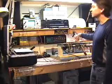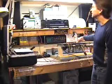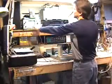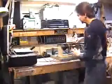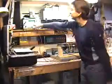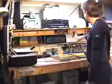I've got all of the tone controls set on medium, on 5, and now I'm just going to start raising the volume. And we're going to start seeing a nice clean sine wave come up. So this is exactly what you want to see. Everything's nice and symmetrical. If one of these tubes were really failing, you would see either the top or the bottom look significantly distorted. And I'm getting a voltage reading now of up to 8 volts.